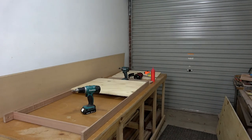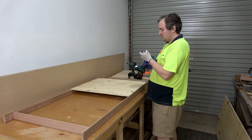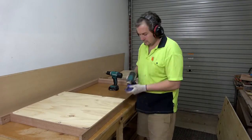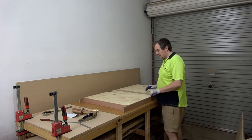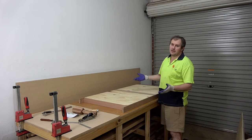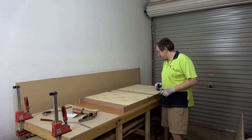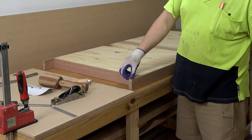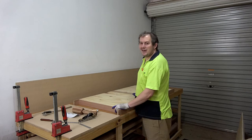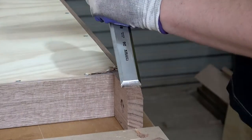I'm going to put gloves on because I'm going to hurt myself doing this. So there's the mattress base — it's got a little bit of give in there but it's got enough strength to hold the weight of a baby, and probably the weight of a big fatso like me if I was to sit on it. Now I want to clean up these sharp corners because this is a visible corner. I want to give it a bit of flair, a bit of panache, so I'm just going to knock the corners off with a hammer and chisel.